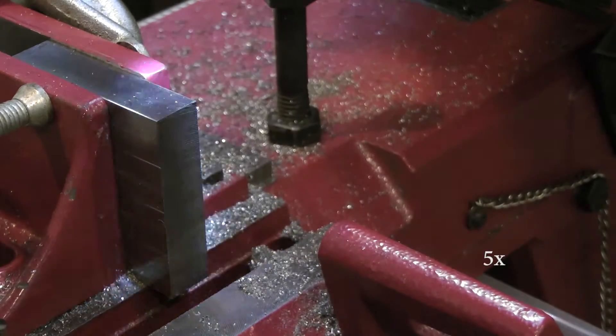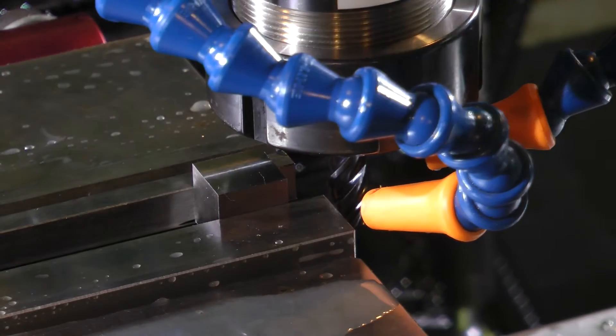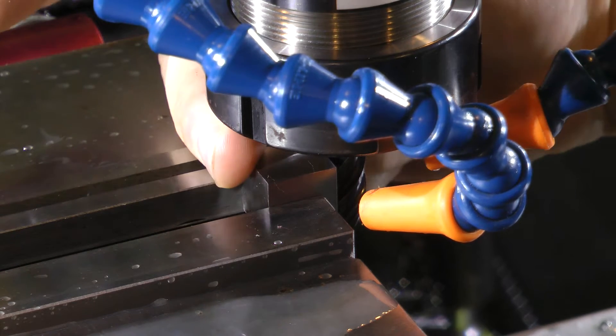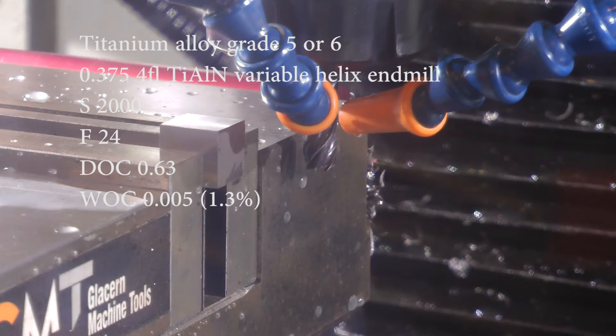This ended up cutting straight up and down quite nicely, and I got them all cut into cubes now. What I'm doing now is taking that bandsawed edge — or the bandsawed side — and cutting it to where it's square to the other machined surfaces. This is just your typical squaring of a block procedure.